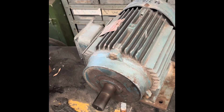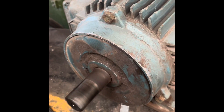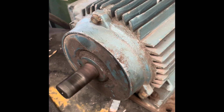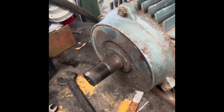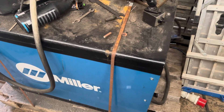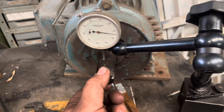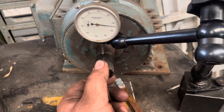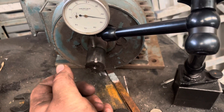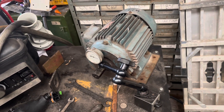I can't tell you what current it's pulling, but on run-down it's got a bit of wobble to it. I'll check that shaft. Not a great test bed on top of the mig welder power source, but it's clear the bearings need replacing. Bearing swap, good cleanup - and it's good to go.